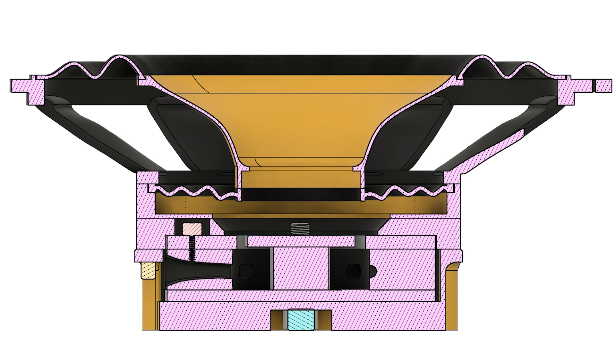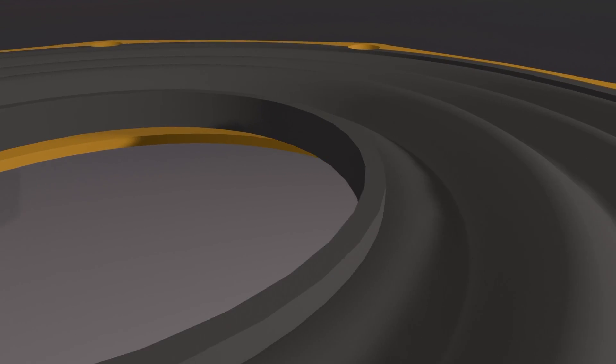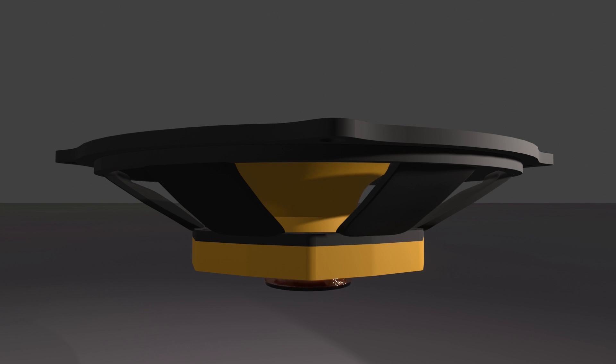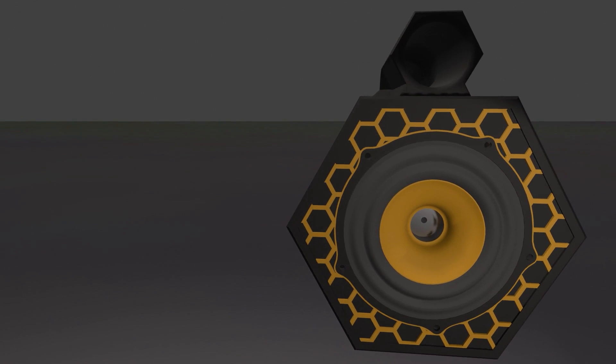For the surrounds, I stuck with the same approach I did on the miniature speaker — using a sine wave to generate the side profile of both the surround and the spider. After various testing with different designs, I've found that a sine wave or cosine wave, a very gradual up and down, gives the most flexibility to the spider and surround, letting the speaker move as freely as possible and reducing resistance to the motor.